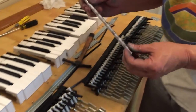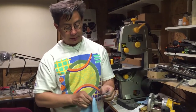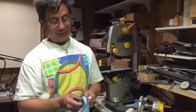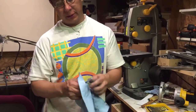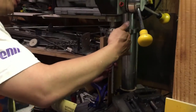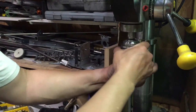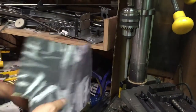The second process is I'm going to take this into the shed and show you what I'm going to do. I don't even know why I'm doing this — it's so late at night. But I like things to work, so sticky keys like that, I don't even know how that happened. I mean, it's not even that old. So I'm going to clean the grease or whatever that's on the shaft in the first place, and I'm just going to stick it in my drill press here. I'll just hand tighten it because the rod is aluminum. And I'm going to take this 600 grit sandpaper.